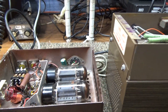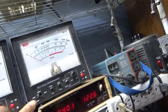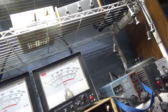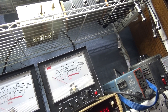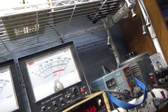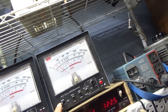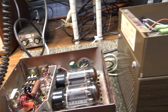It ought to be warmed up — I'm going to put it on standby. On the 20-watt scale set to average, this little mud duck I've been using lately as a basic radio is dead-keying a little over three watts. On audio it's whistling about six, only talking up to about four — so not a big powerhouse going into this thing. On peak audio it might hit 15 at best. Non-modulated mic, mud duck radio going into this amp.